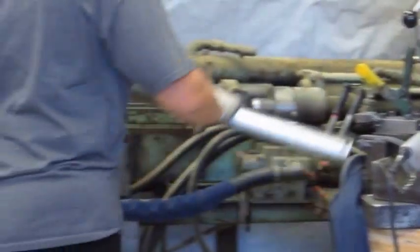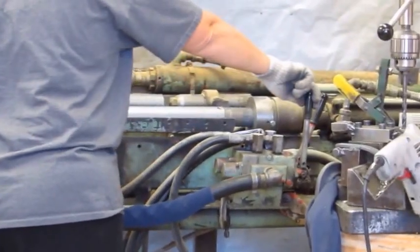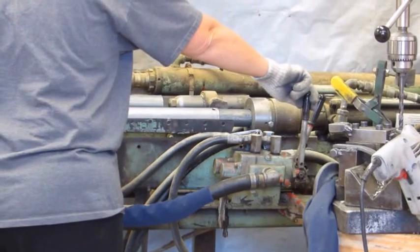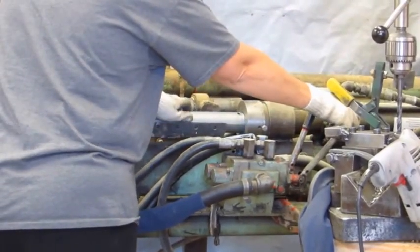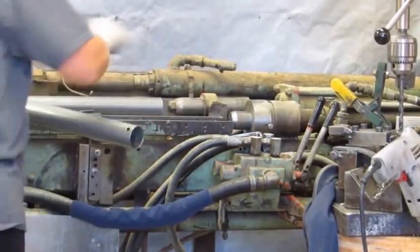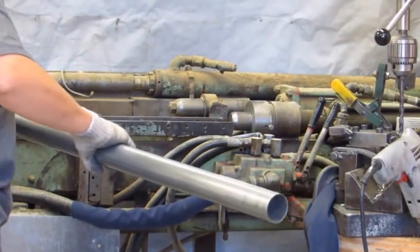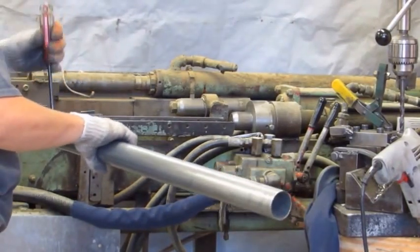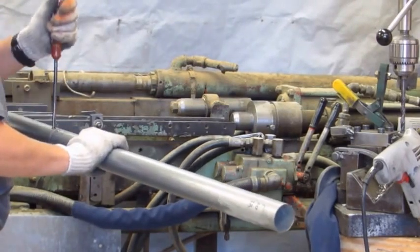And then we move to the swedging operation, which opens or sizes the lower portion of that tube to accept the extension of the lower center tube. And then we check the location of the drilled holes for the master part in both positions, turning it 180 degrees.